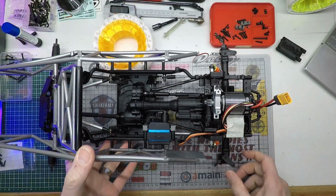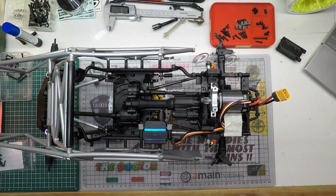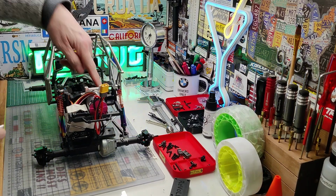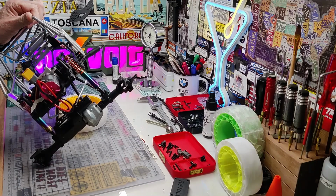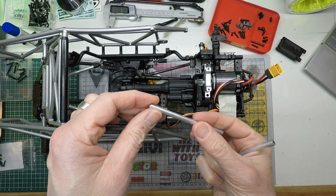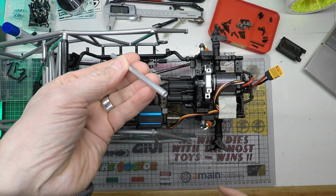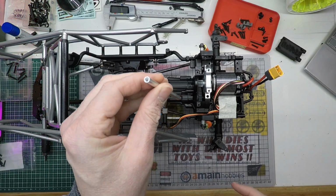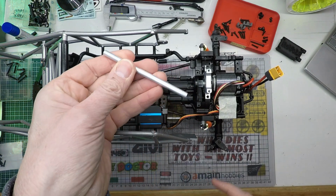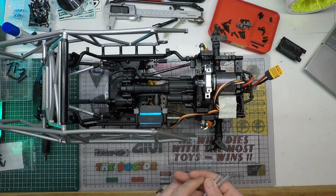Yeah, I'm starting to see some light at the end of the tunnel, because this was a really heavy episode. What am I going to do about these 4mm aluminium links? We will change them out to this, which is 6mm hollow rod with a 3mm center. We then tap some thread in there, so an M4 fits in here, and then we can make links as we want with our tool, and then that's what we're going to do.